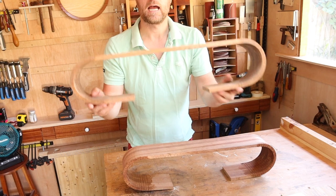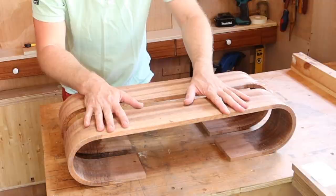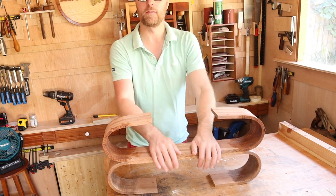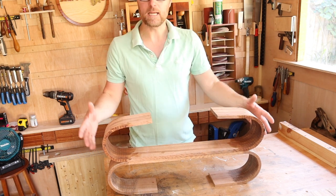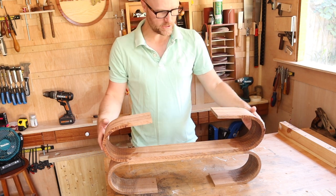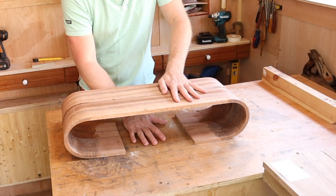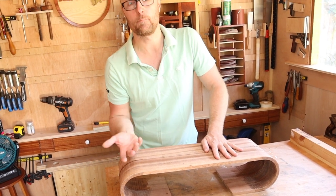This was the experiment and hand on heart I had no idea that this was actually going to work. What are these? I just thought I'd try and bend some wood which I've managed to do. Is it going to be art? Is it going to be a standing shelf like this? If you can get to this stage of a build and make it into something that you love, change it. Or put these together, glue them and have them as a desk feature - put your laptop on the top, slide your mouse and your keyboard underneath them. But here's the problem: if you're going to do that, you should have glued the wood together first, then cut the curves, then bend.